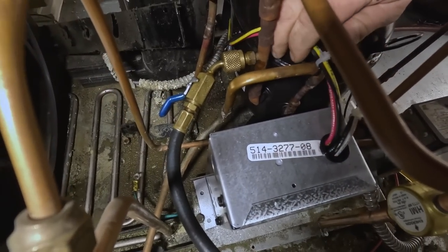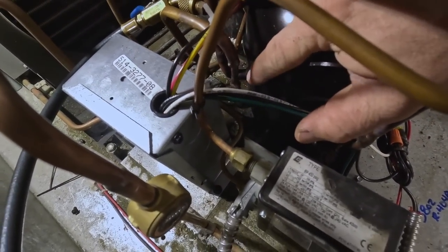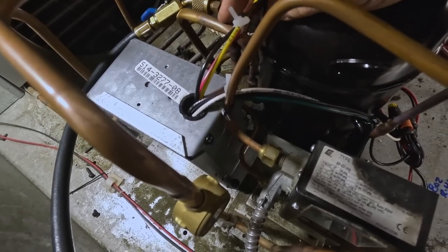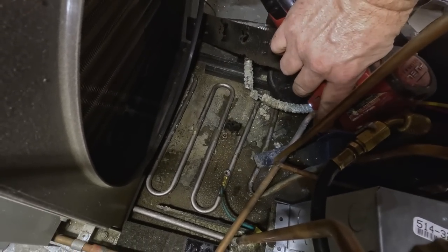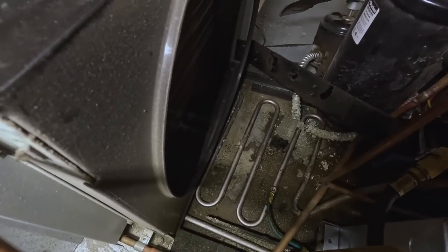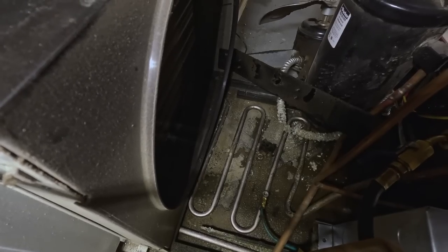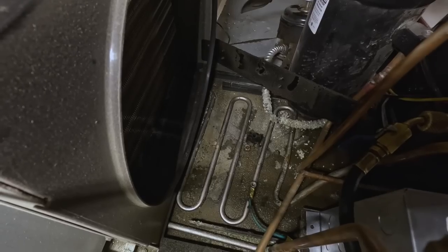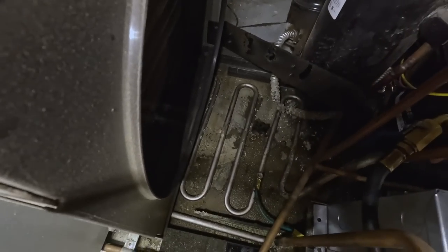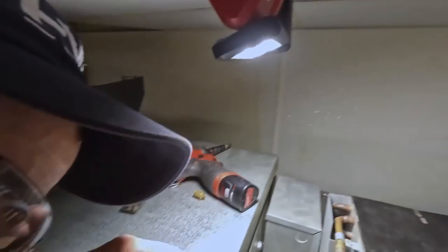So we've got some real creative stuff going on here. We got a quarter inch line going into the compressor here, coming out to 3/8. We're gonna do this exactly the same way. We're probably gonna have to remake it differently. We're most likely gonna make this a little smaller too, because I don't have enough 3/8 copper as I originally had. Just gotta keep in mind that this fan is going right across here and would block it. So we gotta figure out how we wanna do this. I got lots of room up here. That's great.